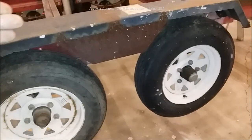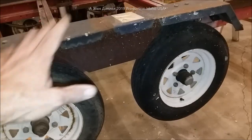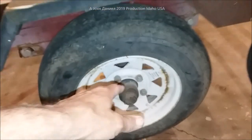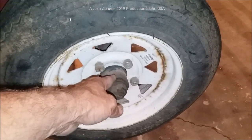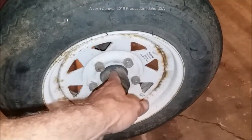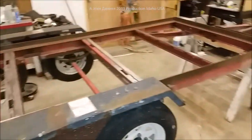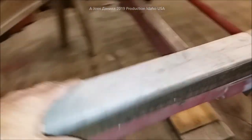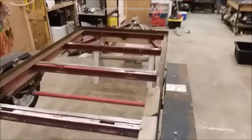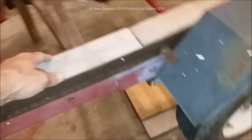But you've got to shave 300 pounds off of that — 7%, it's standard math. What we've got here is an 1,800 pound axle. You can order these axles with a 5-bolt hub and no electric brakes. When you've got something that's basically 50 inches wide and a little over 10 feet long — I actually picked up this whole trailer off the ground and Daniel and Kira put the sawhorses under it, with the tires and all still on it.